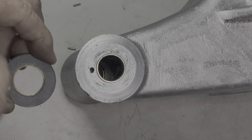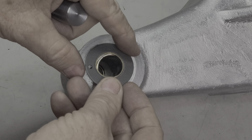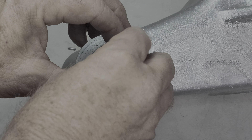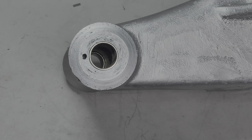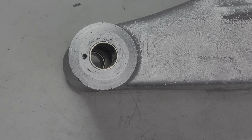We're going to make that right. We're going to use a standard dowel pin that fits the hole properly. We're going to flip it around 180 degrees, stabilize it, then drill in and put in a proper dowel pin. That dowel pin is going to be completely flat across the top - normally dowel pins have a slight curvature to make installation easier, but we want it flat to get maximum strength. That's just the way it was - whatever materials were available at the time.